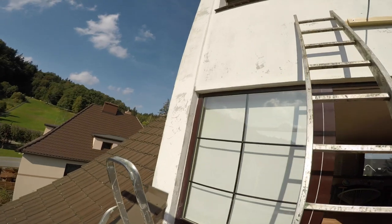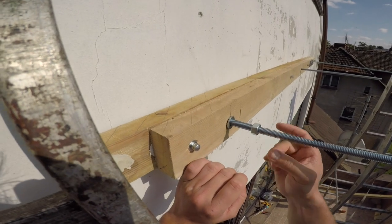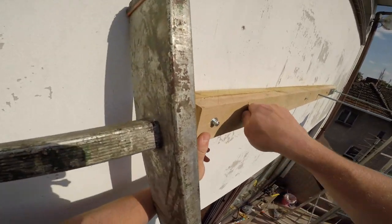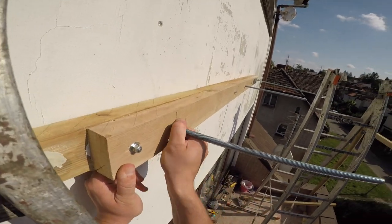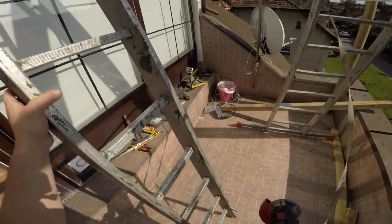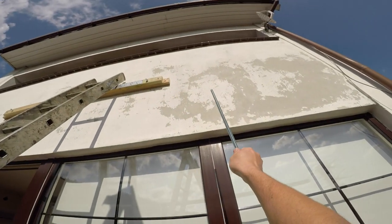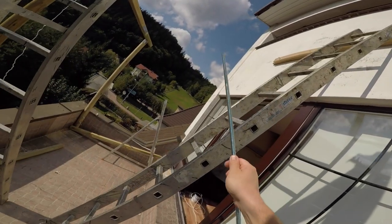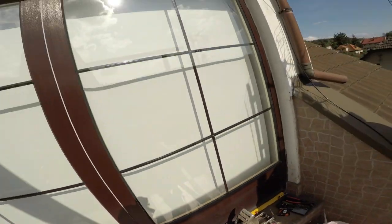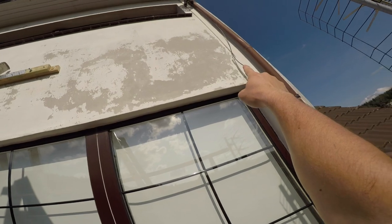Other side ones are gonna be at least interesting, because I need to cut some of that from that. I'm putting the screw in first and then cutting. This is like a technique so you keep the thread alive, because otherwise when you cut you can damage the thread, and then the next nut's not gonna go in. So angle grinder, I've cut that, and now the last one. I'm gonna have to buy more of these, because there'll be one, two here, and one, two there. I've got that and this, so I'll need at least one more. That is, if I'm not gonna make three, like here. Put one in the middle, and then one there, one there.